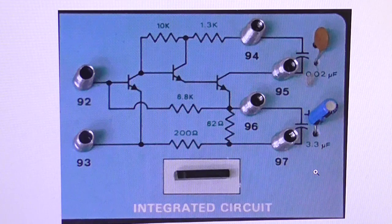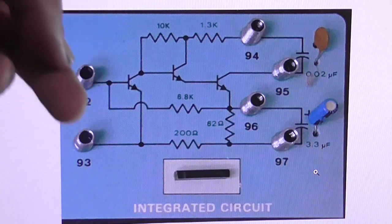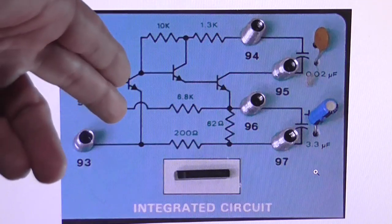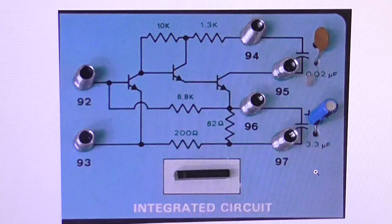A lot of the other in-one kits supplied op amps, and I think one of them even had a digital gate IC on it. Anyhow, only about six projects used this particular IC. It's a BA306 or an NTE1431, which was only used in about six projects out of the whole entire book. I probably only built about one fifth of the projects — only the stuff that interested me. But they should have used this IC in a lot more projects as far as I'm concerned. It's a general purpose amplifier and, according to the data sheet — which is very sparse — it's known as an audio driver. I have actually built this out of NPN transistors before, back when I was like 13 or 14, and I know it does work outside the IC with discrete components.